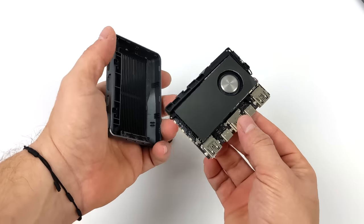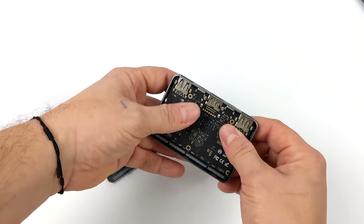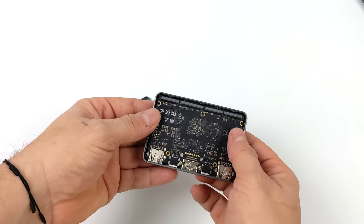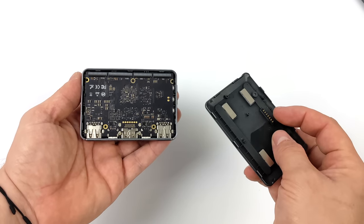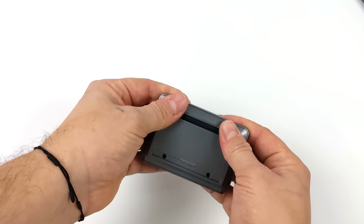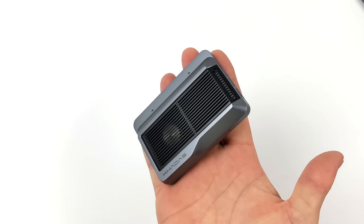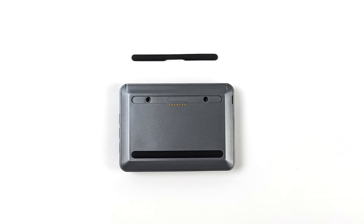On the Edge 2, there are three physical buttons that are fully accessible with the case installed. You basically slide the board right down in there, make sure all the ports are lining up, and two screws hold it in from the bottom — those screws also hold down the heat sink inside. Make sure you have those out before you put the bottom on. It will only go on one way, making contact with the pogo pins. Once our screws are in, we can add the rubber strip so it won't slide around on the table.